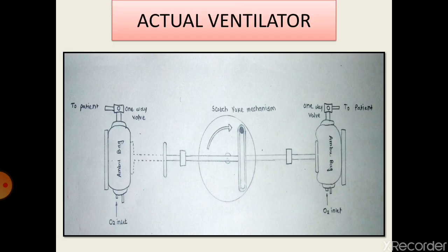Now, this is the actual design of the ventilator. When the motor rotates, it will drive the rods in both directions — left and right — using the Scotch Yoke mechanism. The ends of the rod are supplied with plates. The plate will press the Ambu bag to help get it compressed.